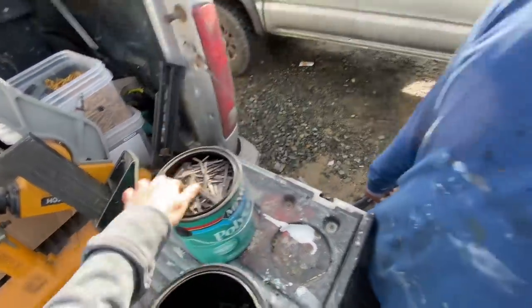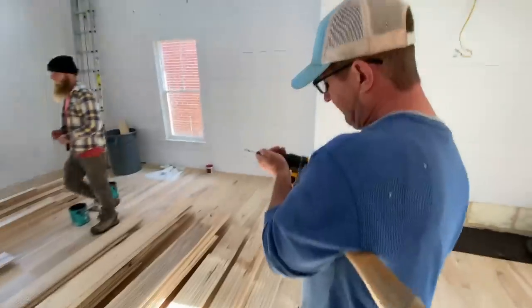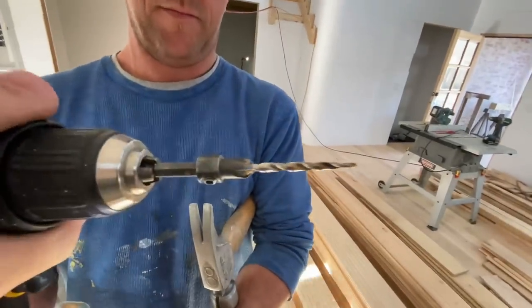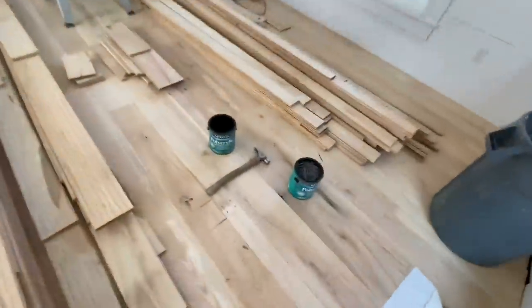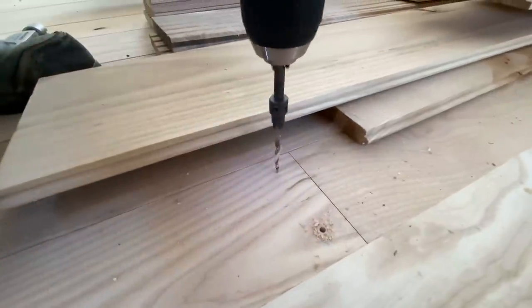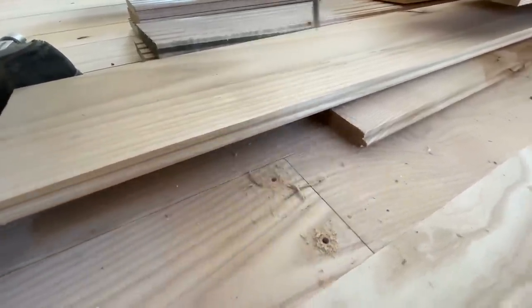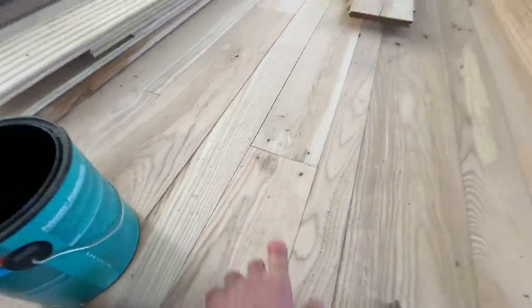Cut nails - we're going to do something special. We are going to nail a bunch of cut nails into the wood flooring. We're chucking up some drill bits - we are using a tapered drill bit. Pre-drilling for the cut nails because they are actually tapered. We tried a bit that was not tapered and that's what we got - a nice jag right there. So we'll run the tapered bit in there so we don't split. We're just nailing the ends of the boards, and if we have extra nails, we'll go down the length of the boards.